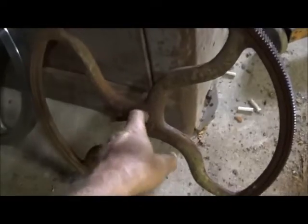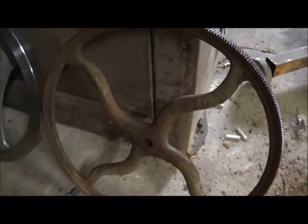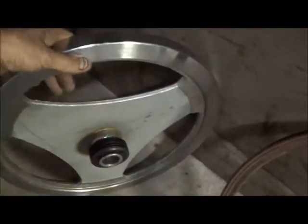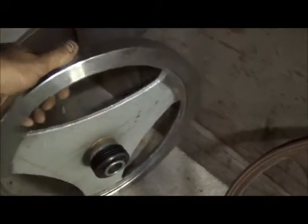I think I'm going to use the gear. I'm going to have to bore the hole and cut a keyway in it, or broach it in. I like that wheel — it's actually the front wheel off of an exercise bike, and it had plastic covers over each side of it to make it look like it had spokes. I picked it up for junk. I think I'm going to use that flywheel on a beam engine that I have planned.